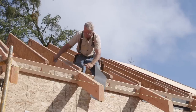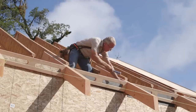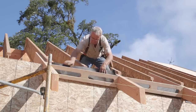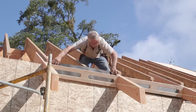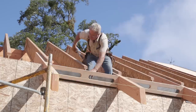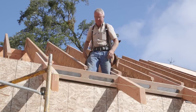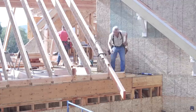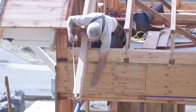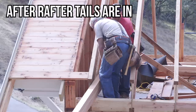I'm tacking this tar paper behind the bird blocks just on the off chance that a person would be able to see up through the vent and recognize the OSB. I don't think this is going to be possible once the roof is on, but just to be certain I'm putting a little barrier in there. Think of it like black paint that is instantly dry to the touch, and it will also help just in case some water squirts up here — like if a kid gets carried away with a hose. These vents are probably a bit bigger than they actually need to be to vent properly, but I didn't want to take a chance. We live in a wet environment around here and mold can be a real problem.